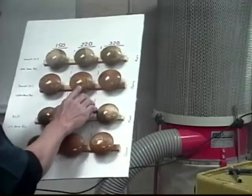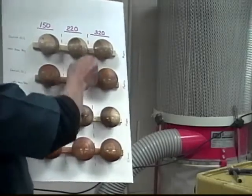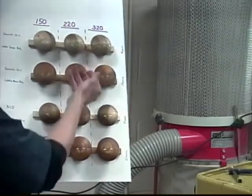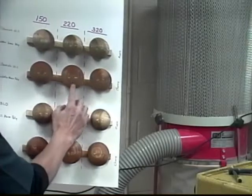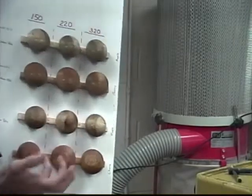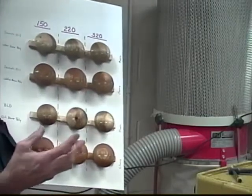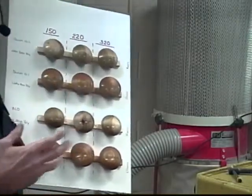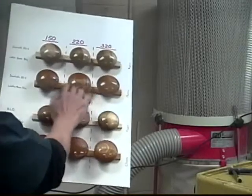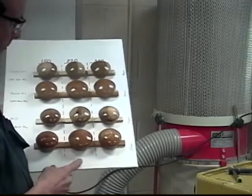Kelly was talking about how that Watco is so thin. If you look at this one knob in the middle, they all had 3 coats, by the way, the grain was kind of vertical to my split on here, and it sucked that Danish oil right down through, and it's actually bled through where I didn't even paint it. That's how capillary action works with the finish. So it's good if you're using just your Danish. That shows there's penetration through the whole bowl, so you end up with a better sealer on the grain, so it's not impacted as much by water or food. But in this case, it kind of wrecked my example because I had the water-based poly underneath it.